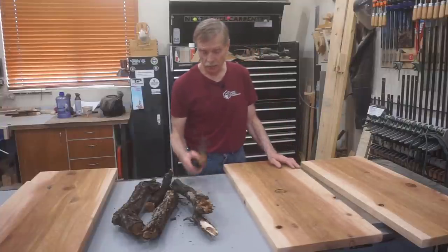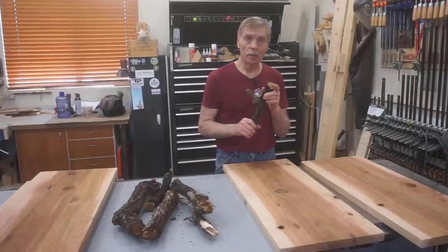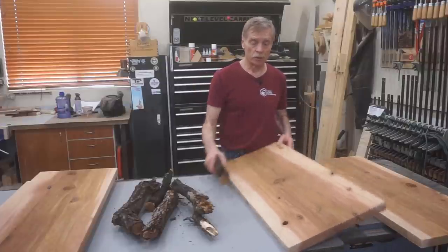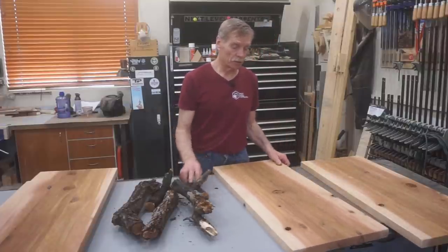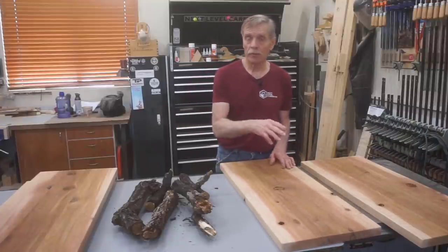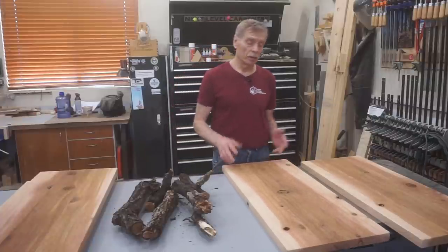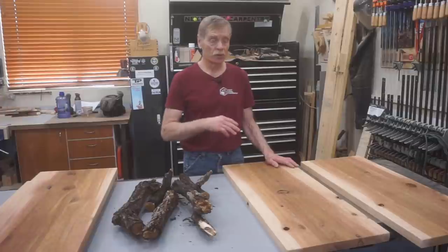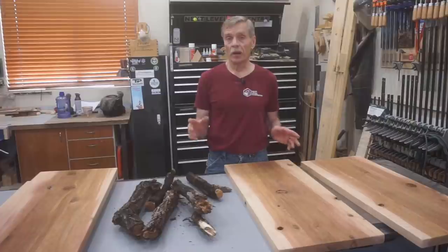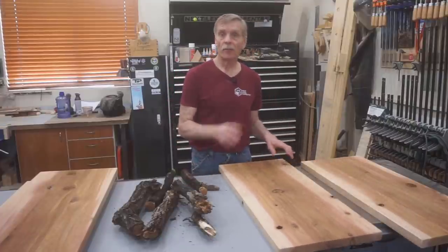The second ingredient is naturally going to be the wood that's used. Wherever you get the pieces for these repairs, it doesn't matter as long as you're comfortable with how it looks. This is rustic cedar, red cedar, and I'm using oak for the repairs. If I had cedar that'd be better, but I don't. This procedure works for other types of wood — knotty alder, rustic hickory, etc. It's mostly a matter of picking a good wood for a good match in the type of wood you're repairing.